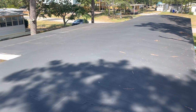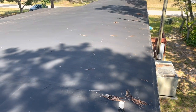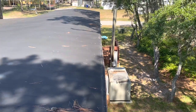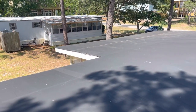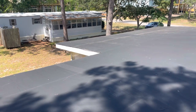We're getting ready to remove this, all of it. We're going to just cut it off here at the edges, get rid of the rubber, and install our OSB like we do with our six-inch overhang, except for on the porch area. The porch area has rubber, but underneath that rubber is what they call peel-and-seal rolled roofing — it's like a peel-and-seal with granules on it.